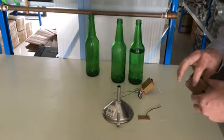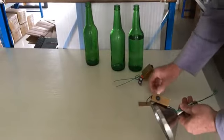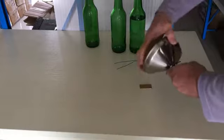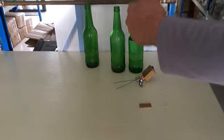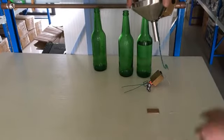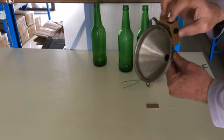Here's the e-funnel. I put the clip on like this, take a bread twisty tie, and tie it on — that's good enough. I bent the wires down so that if liquid goes straight down, it doesn't complete the circuit; it'll fall off this little bend without being able to go up, keeping the circuit from being accidentally tripped. It has a buzzer, LED, and on/off switch.